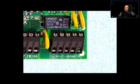So the system steals the line, hangs it up. If somebody was on the phone, it's going to cut you off, hang up and pick it up, dial the number, communicate with the station, hang up and release the line. And the station has received the signal. Depending on what the instructions are for this particular system, the personnel that is there 24/7, there are live people there, they're going to react in a certain way. How are they going to react? They're going to call police, or they're going to call you, or whatever the instructions are. So that's the communication thing here.